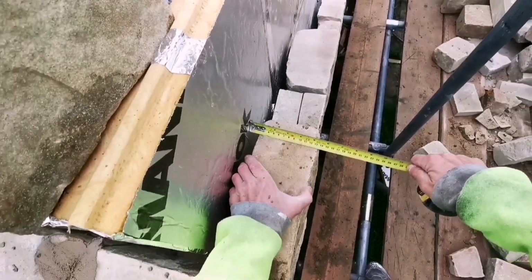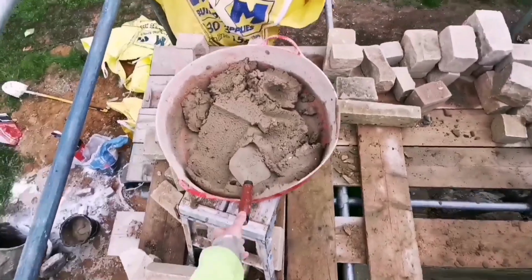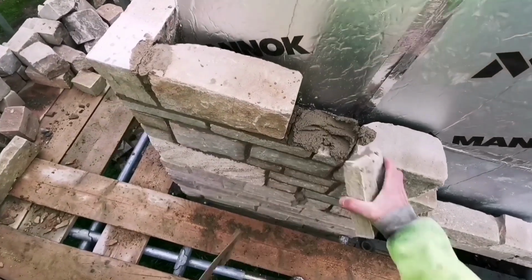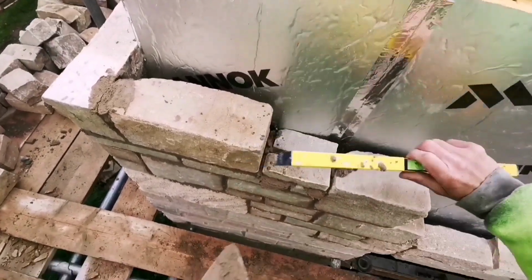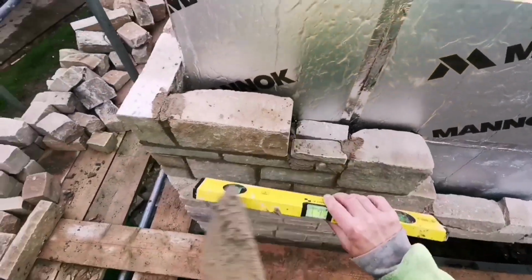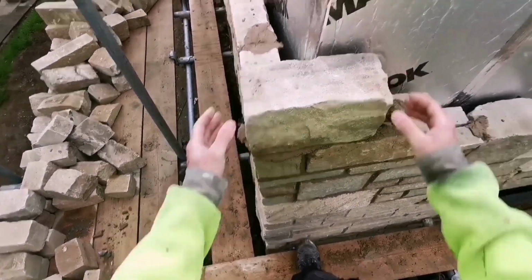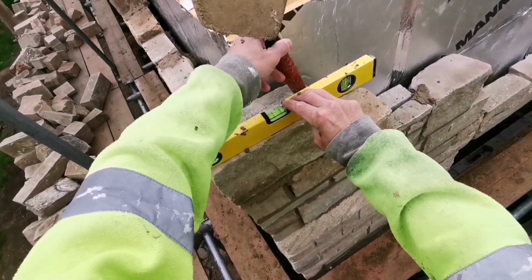Are you ready to come up here, Tim? Start putting a couple of water tables dry for me. It's raining already, I can feel it. We've got that block work to do anyway inside if it starts chucking it down, so we'll just use the same mix because it's only one course below ceiling. So we'll just use this sand, cement and lime mix we've got.